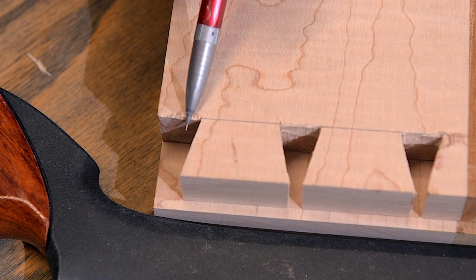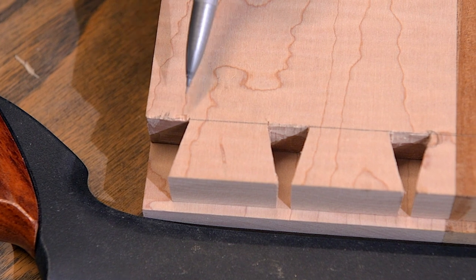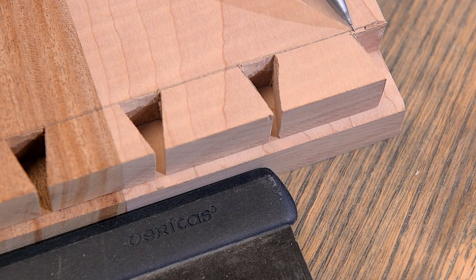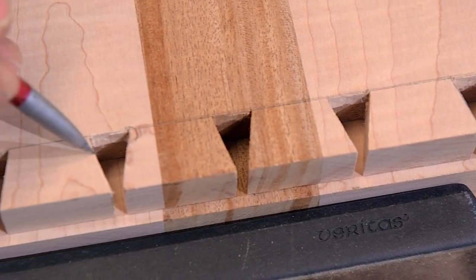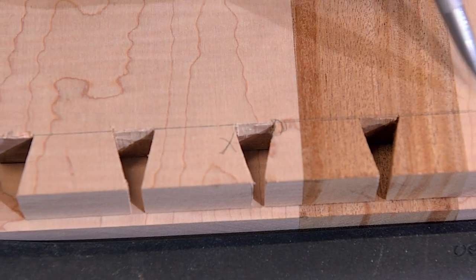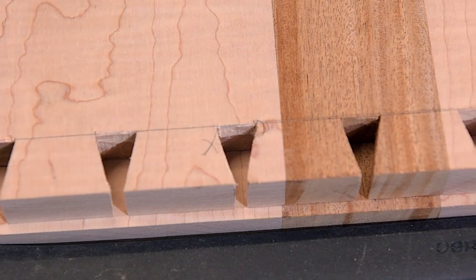So if you recall, we cleaned up our shoulder on an outer half pin over, and that really let it seat on there. And now that it's seated a little bit more deeply, I can look on the other side and notice the same thing is happening on this shoulder, so I need to clean up this side as well. Looking at my other pin sockets, that's what we call the mortises that receive the pins, I can see that there's a little bit of crushing on this one. The others really aren't indicating anything yet. As we get deeper, we'll find out.